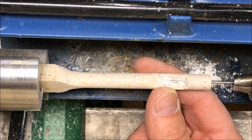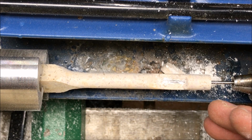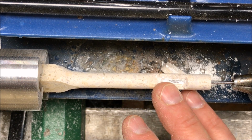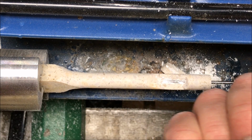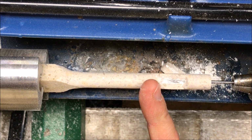and I went about a half of an inch, maybe a little more than a half of an inch into the blank. I probably should have gone about a quarter, backed it off, cleared it out, and then gone back in. What happens when you don't clear the bit often is it builds up a bunch of material, and that material starts to swell, and it's heating up the inside of the blank, and materials like Corian and some woods just don't hold up real well.